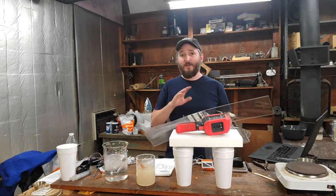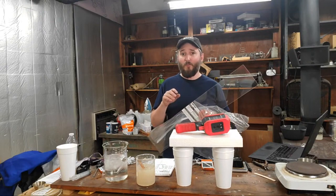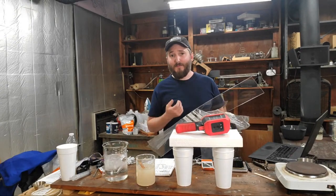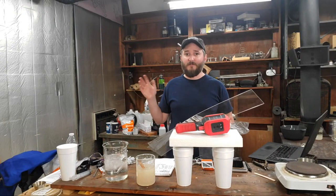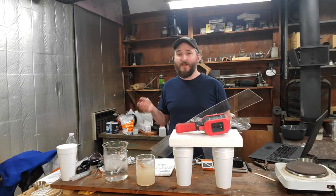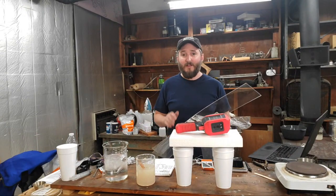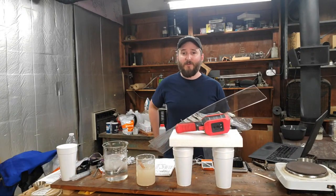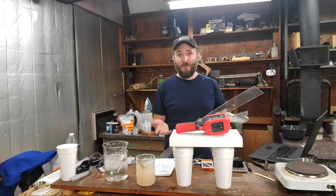You can get a radiative cooling coating to work just with this acrylic and the water and acetone mixture, and add in, I haven't tried really common white pigments like titanium dioxide, but I have tried amorphous off-the-shelf barium sulfate that you can get on Amazon. If you can find ultra white calcium carbonate that's not contaminated with something that makes it yellow, that will also work as the pigment in a radiative cooling coating. You don't have to go through the trouble of making the microspheres for fairly good results.